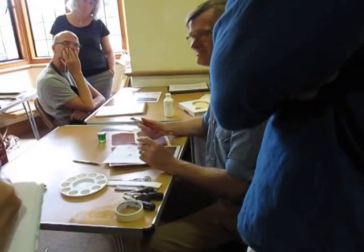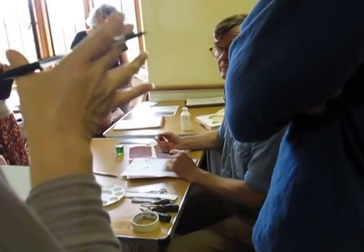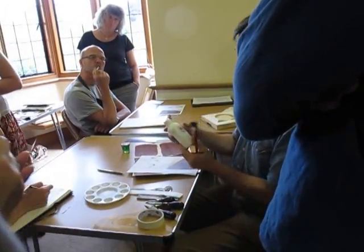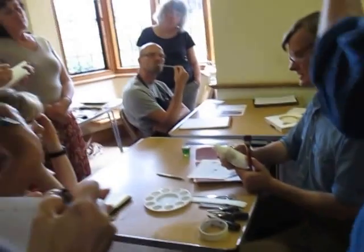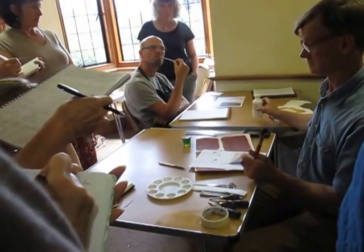Wow. Okay. But you can work it after 20 minutes? Yeah, we'll find out. After you apply, you can work it until 24 hours? At least, yeah. But this remains open for ages. Yeah. Water-based gold size, ready to gild in about 15 minutes, but will remain open indefinitely, it says, and yeah, next day even.